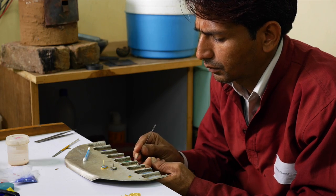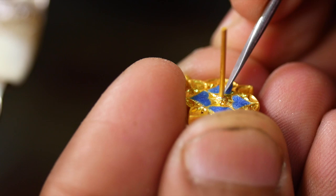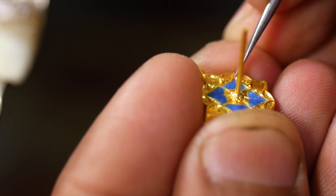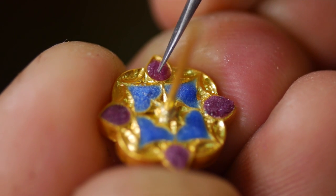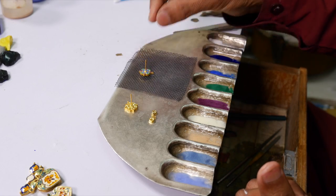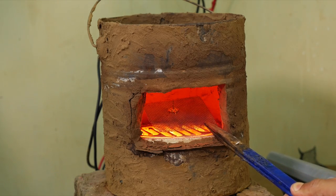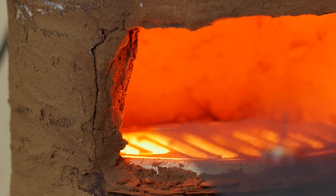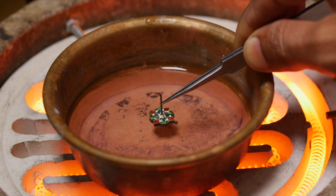The paste is applied to the engraved fields. It's then dried and heated to melting point in a kiln. The enamel is sanded smooth and given a final firing to gloss the surface.